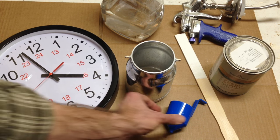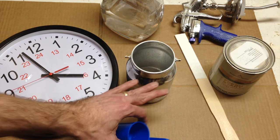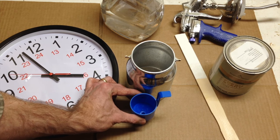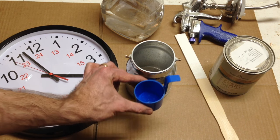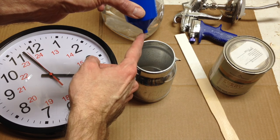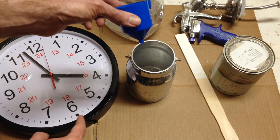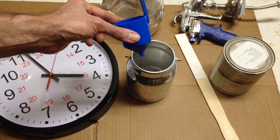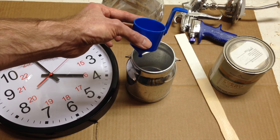To measure the thickness of a finish you need a viscosity cup. What I do is put the finish in my container and put the cup inside until the fluid's over top of it, then I start timing. As soon as that lip breaks the surface of the fluid, I time how long it takes for the fluid to start to turn to a drip. I've got a clock here I use as that reference. That tells me how many seconds to get through the cup, and I use that with my reference guide to figure out the right viscosity of the paint or finish I'm working on.